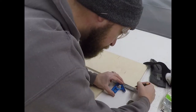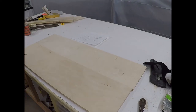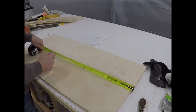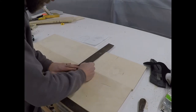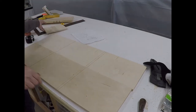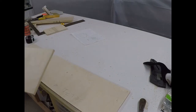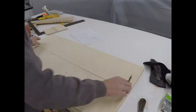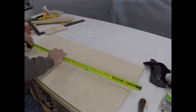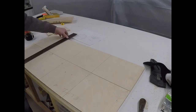Here I will mark out for my dados. I make a mark a quarter inch in on the first shelf and line the bottom piece up with it. The shelf will sit into the sides a quarter inch into a dado slot. I then mark out the spacing I want for my shelves — you could make this any spacing you wanted to fit your needs. There will be dado slots on both sides of all three of the shelves. Remember to put your dados in different spots from the top to the bottom of each shelf — if you put them in the same spots it would weaken the shelf.